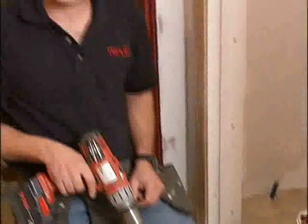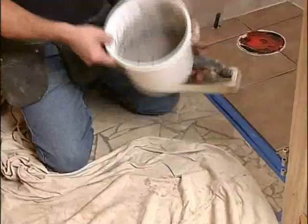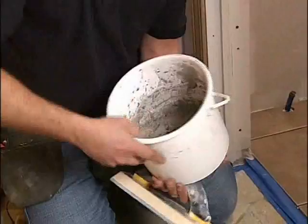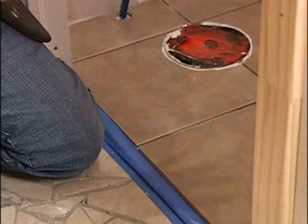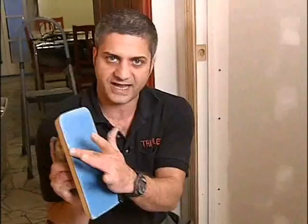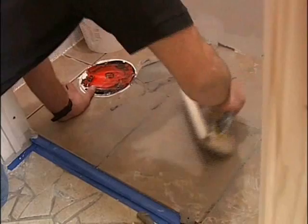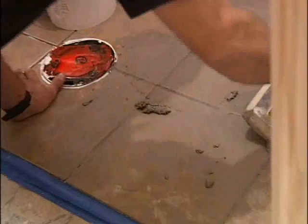Hello, I'm Just Ask Bob, welcome to our job site. Today we're talking grout. We've got the tiles — they're dry for at least 24 hours, the longer the better in most cases. You want to make absolutely certain that you've mixed your grout properly. Properly mixed grout: toothpaste consistency. Equally as important is the tile — very thorough, good detailed cleaning. Make sure that nothing's inside the joints; the thinset sometimes wants to ooze out the middle, so scratch it off, clean it off, make sure nothing's in the way. When you're applying this, lots of elbow grease. Keep passing at a 45-degree angle. Get a generous amount down and just keep pressing and pressing.